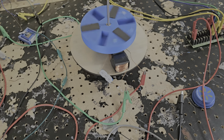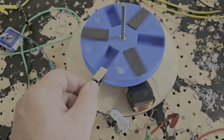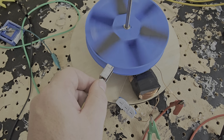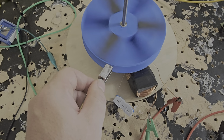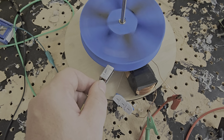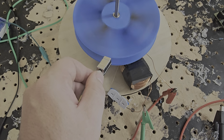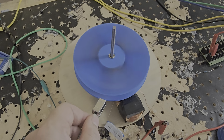So I'm thinking that I'm going to do the 3 coils as I described here. And I'm going to do them bifilar. And because this is the trigger strand wrapped into the drive, we're doing 0.5 amps and 21.1 volts. And look at that thing fly.